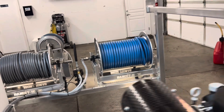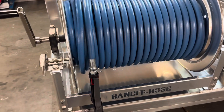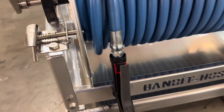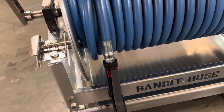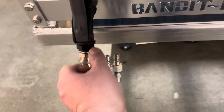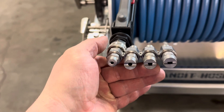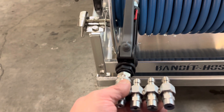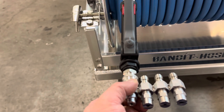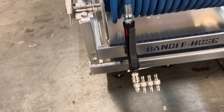The outlet side goes all the way over to the hose reel. Half-inch hose. We like these Suttner 510 guns here. This is half-inch crimped onto the hose. You can do it the cheaper way with a half-inch barb and hose clamp, but we've found those tend to be failure points in the future. J-Rod. Here you're going to have a zero degree, 15 degree, 25 degree, and 40 degree — these are just different spray patterns. You want to be careful: I see a lot of people who just want to match up nozzles because they like them, but these really need to be dialed into whatever type of system you're setting up. If you have questions about this, consult a professional.